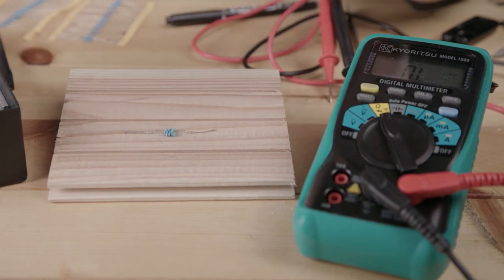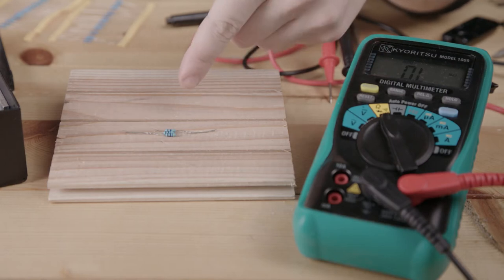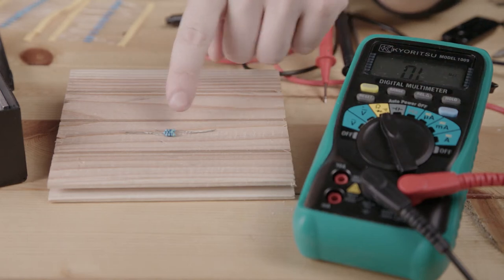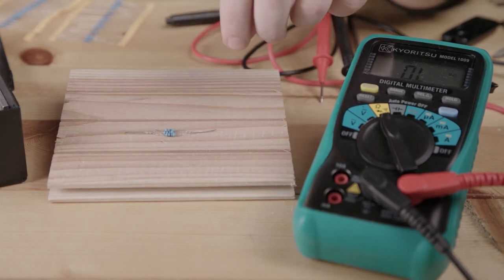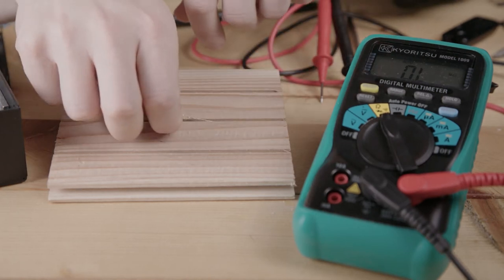So you can see when we try to create more power dissipation, more wattage, by combining the resistors, we end up with a new issue that the resistor's value must change in order to get what we want. So if we want about 47 ohms and we want to go in parallel, then what we need to do is take three 150 ohm resistors and we'll end up with about 50 ohms finally.